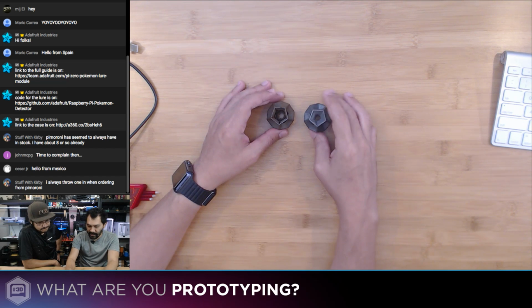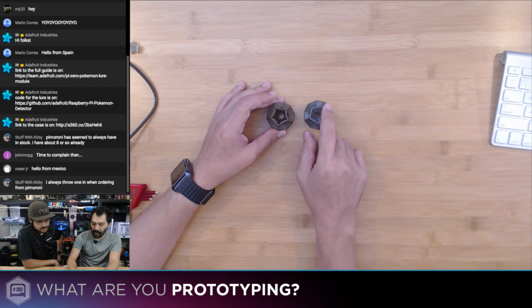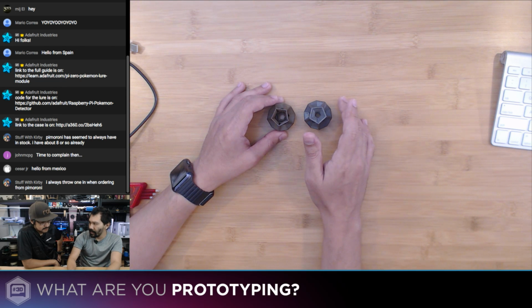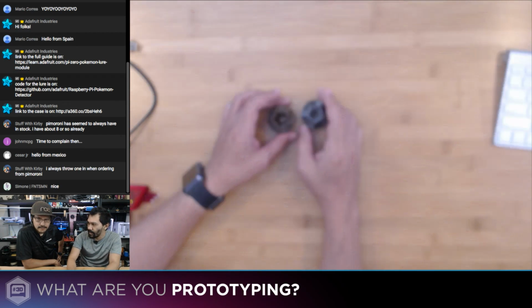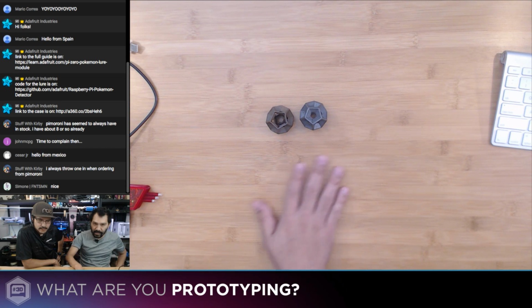Of course, the con of that is that you're going to have to print a lot slower with the steel fill. It is a softer material. So when we tried running both of these through the Bowden extruder on the Sigma 3D printer, it always clogged. No, but that's because we were using 175 on there. I'm sure the 285 would work just fine. Okay. But just some rust pros and cons.